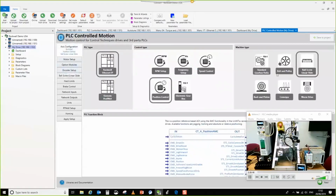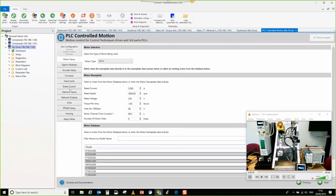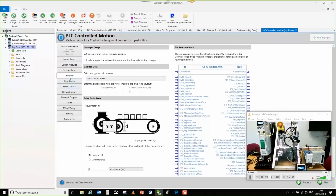So let's choose a mechanical transform that's both linear and has a gearbox. If we just choose conveyor, I know it's not the correct name, but it has the kind of properties you're interested in. It was 667 or something like that that you chose? We're going to choose millimeters, and you are saying it's 50-to-1, is that correct? Well, this will be close enough. Okay, that's fine. The transform is motor 50-to-1 gearbox, so that you get torque improvement to whatever the output load is.